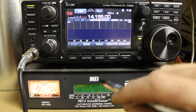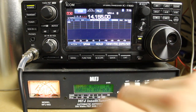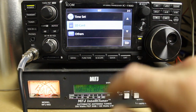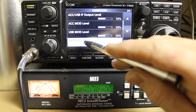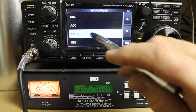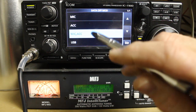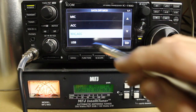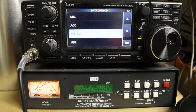Another common problem is that you'll end up with no output on single sideband. What's happened there is that your USB Data Off Mod has probably been set to USB or Accessory, and mic is not in the list. A lot of times control software — various different packages — if they're not polite, or if they crash, they'll leave mic turned off. I've even seen RSBA1 do this.